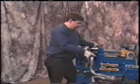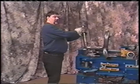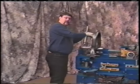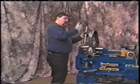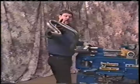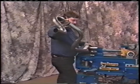The next bend, which I'm going to show, is you see how this kicks straight up, but how we're still at an angle. So we need to do two things. We need to bring this down, and we need to bring it back in, because this part is drifting to the outside of the car. So this bend controls your down and in to bring it level into the quarter panel. I'll bring that again in tight into that die. I'll bring this up, and I call this the fall method. It wants to fall backwards, wants to go the other way. I bring it right in between there, and that's where I'll put my 30 degrees.